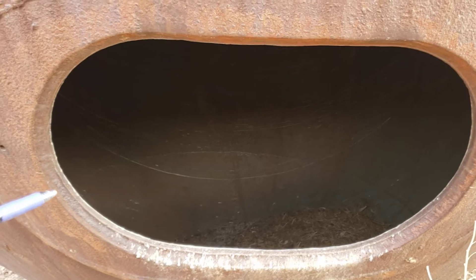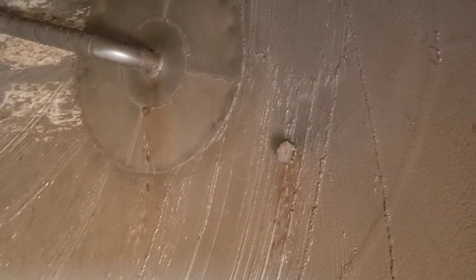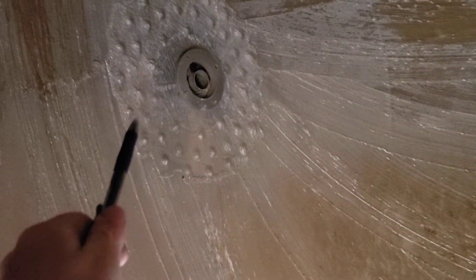It does have a telltale hole, and you can see it's got this big old massive fillet weld on the inside and outside neck. What I wanted to show you also is the inside. There's a lot of reverb and echo, but look at all that reinforcement weld — that's not a coating, that's actual weld metal buildup, and it is everywhere. The hoses were hollow so that they could vent, I would imagine steam or something like that.